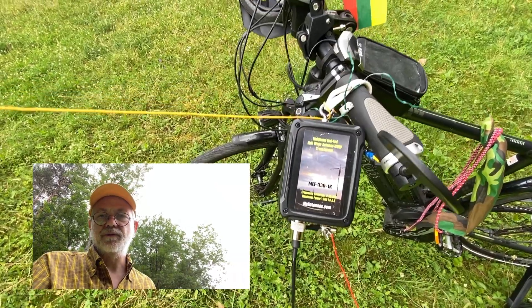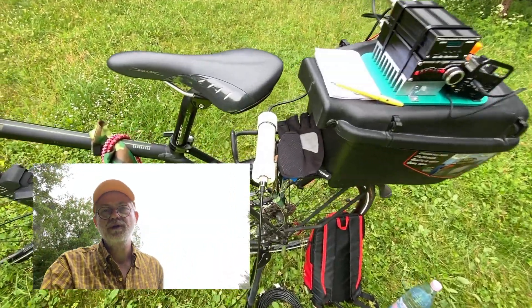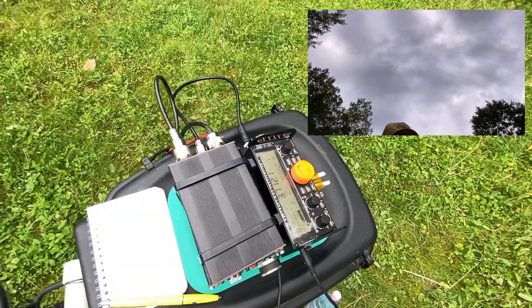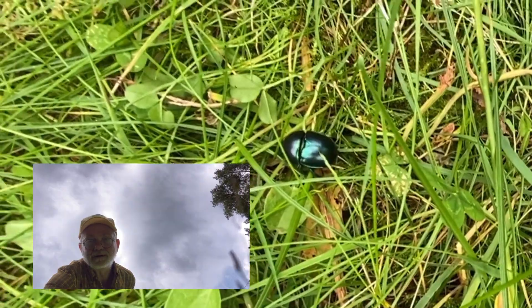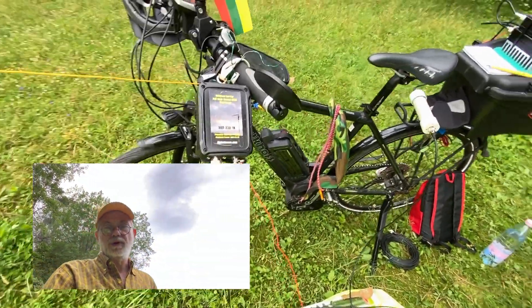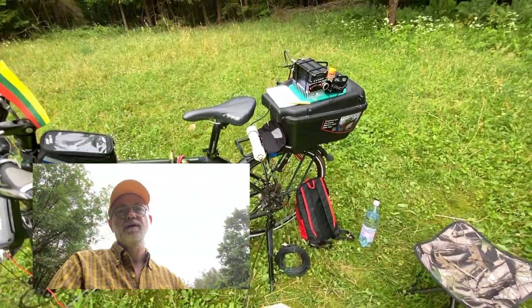Well, I have what I have. It works very nicely. It's fixed to the handlebars of my e-bike. Just three meters of cable go into the MFJ RF choke and then into the power amplifier and transceiver setup. The red wire here is a counterpoise — 0.05 wavelength on the lower band, which is 80 meters. It's four meters long. And this guy here lives here, so we need to be careful.